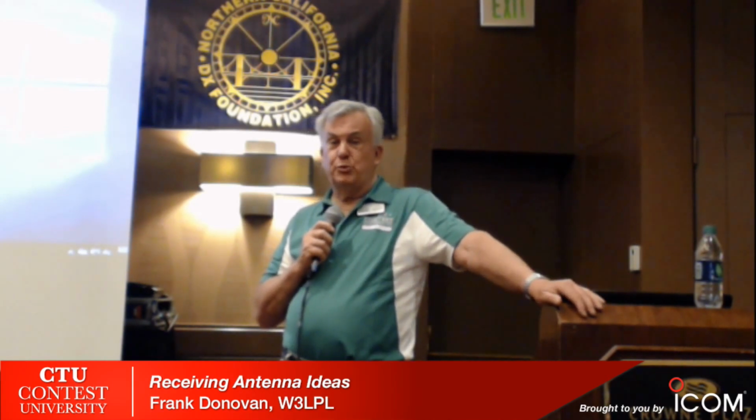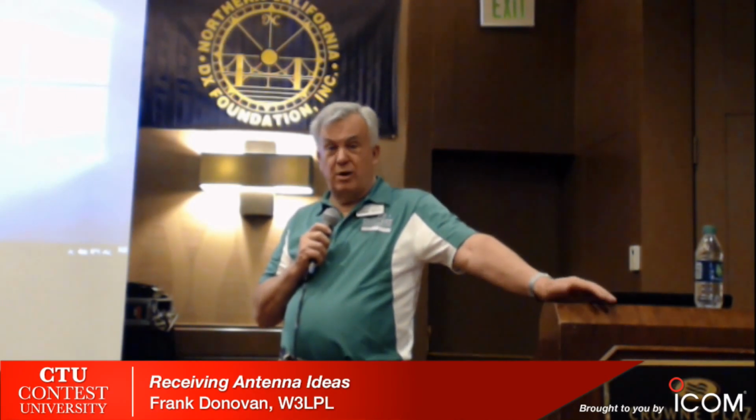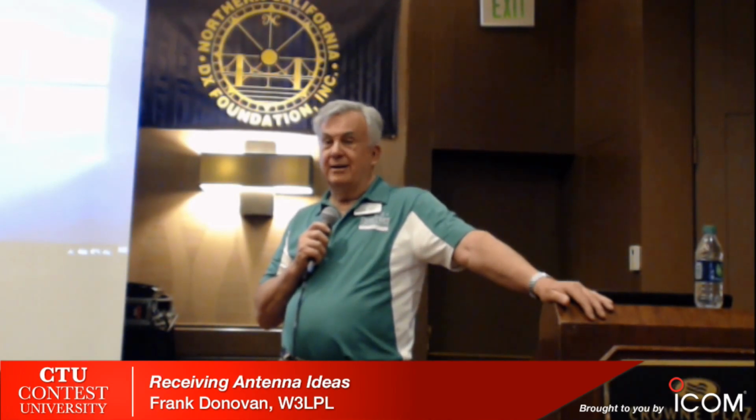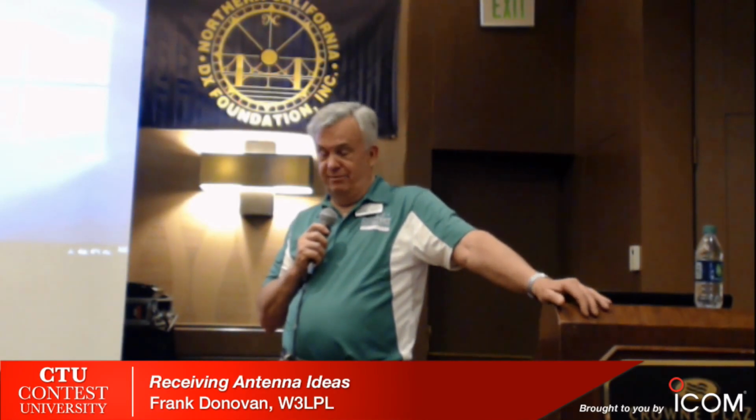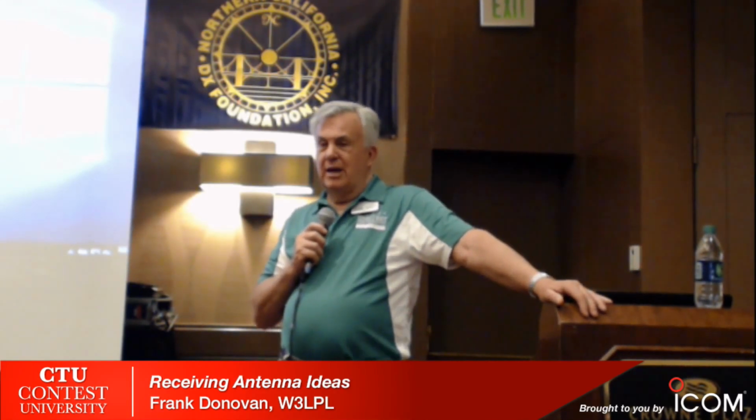And the antenna you're talking about, the roughly 500-foot Beverage, is by far the most popular receiving antenna on 160 of any of them. The great thing about Beverages is they just want to work. There's hardly anything that can go wrong with them. And the things that can go wrong with them are kind of obvious. You know, the support pole has fallen down or the wire is broken, or something really simple. So they're a wonderful antenna, and they have really good directive properties.